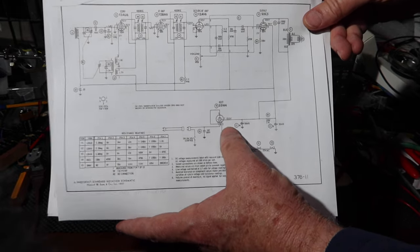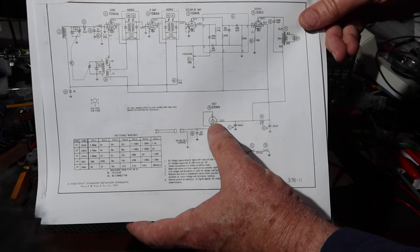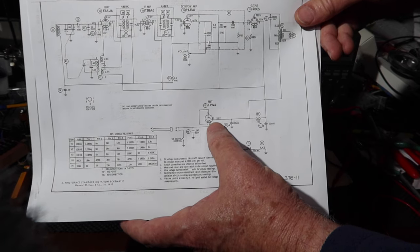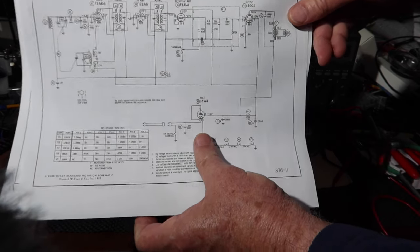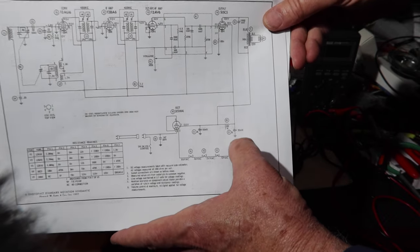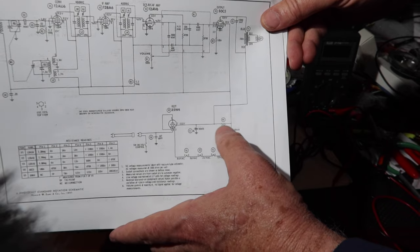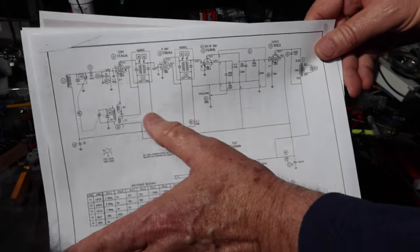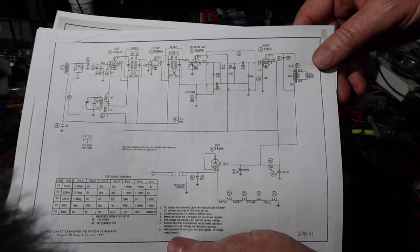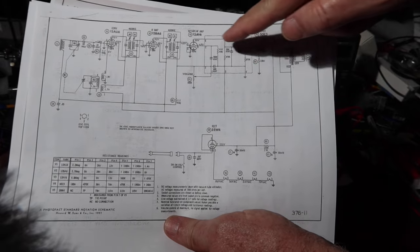It didn't have diodes like we have today, so it had a rectifier tube in it, in this case a diode, that would give you rectification. And then there's a set of filters that provide some smoothing of the ripple. And then it goes off, and this provides the high voltage that goes into the tubes. Now I say high voltage, right? This has vacuum tubes in it. The rectifier is one, and there's four others.